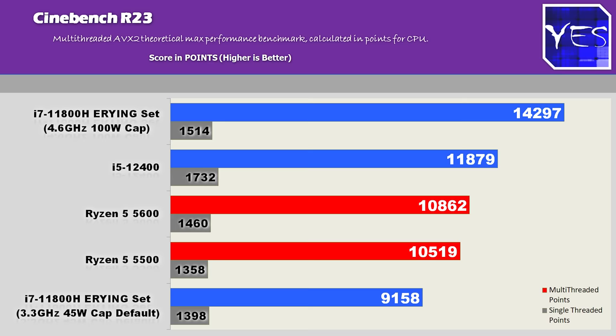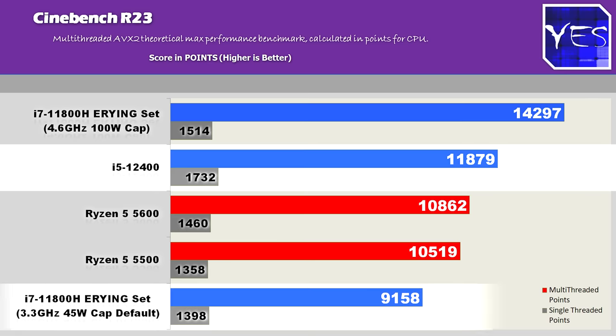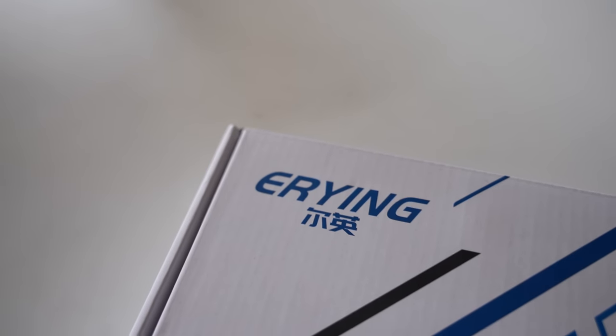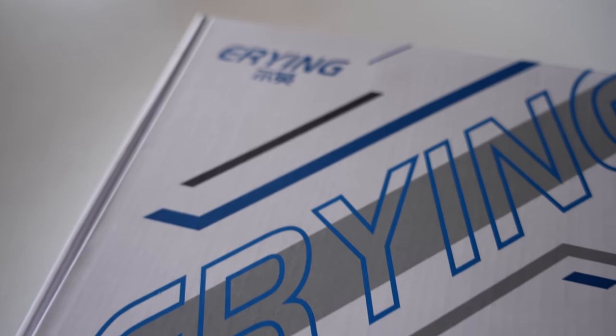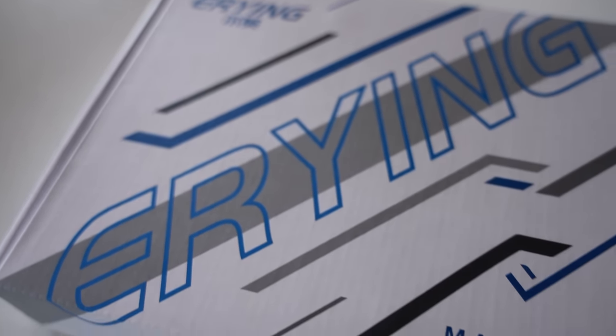When we compared it against the three desktop CPUs in Cinebench R23, the 11800H pulls handily ahead. But if you're using a 45 watt profile — which is the max I would use given the VRM — you've got to significantly downclock the CPU, and you're going to consistently get 9,158 points. In other words, it's much better to go out and get a Ryzen 5 5500 and a decent B450 or even an A320 motherboard — that will give you more consistency in long-term performance, not just for gaming but also for productivity.